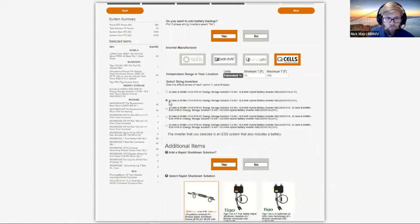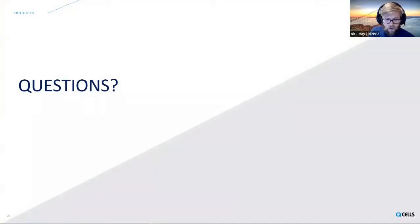Very simple, very easy to generate a full bill of materials for a project. Now let's start jumping into questions. The first question: if you have a PLC, why would you need a receiver? That's related to the rapid shutdown. On the earliest versions of the Q-Home product, the receiver is not integrated into the device. But on the newest versions being sent out now, it is integrated. So if it's a situation where we're using one of those earlier units, we'll work with the installer to make that happen. Nowadays, it is integrated into the unit, so you're correct in saying you don't need an external receiver in that situation.